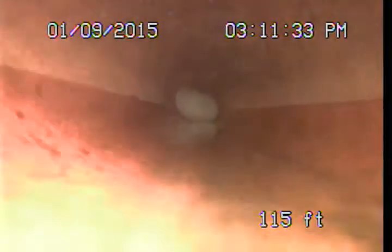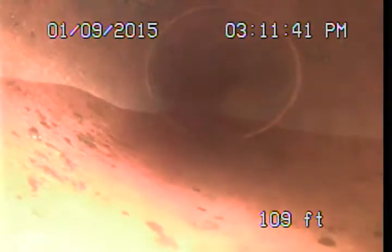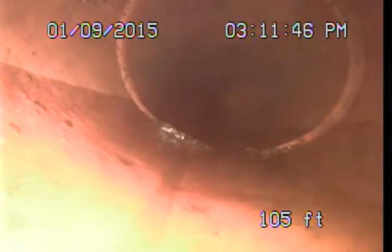As we pull off the public sewer back into the 6-inch clay, it's pretty clean. Those are some loose remnant roots there, knocked loose from the camera after the cleaning. Real clean beyond it and real clean up to it. We'll pull the camera back to that point and see if we can get a good clear view of the joint and see as much as we can. What I'm hoping is that we see enough to conclude that there's no damage necessarily, just that the coupling has been compromised.